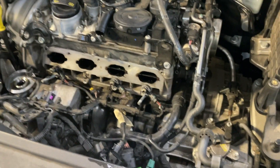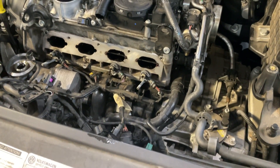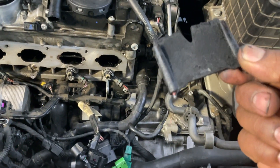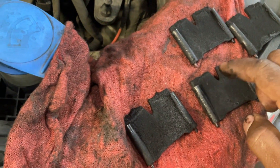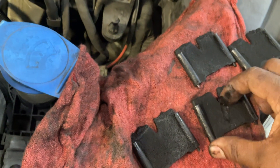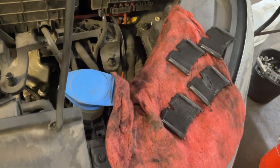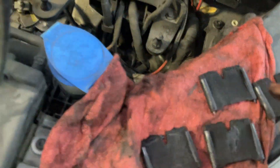Sometimes the reason why you get a misfire in the morning could be excess carbon in an intake valve. This is a sign — carbon buildup. This is a decarbonation situation. It could be from bad gas. This will give you a misfire in the morning when it's cold, check engine light on blinking, and then going away after getting hot. Most likely you need a decarbonation.